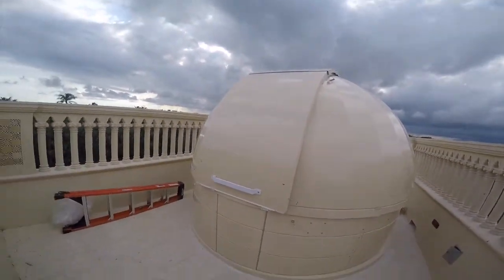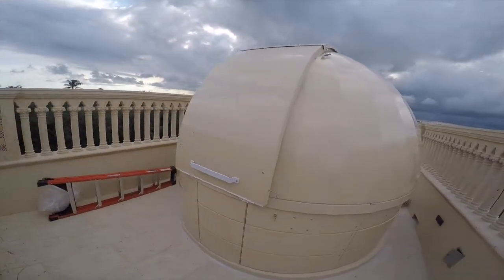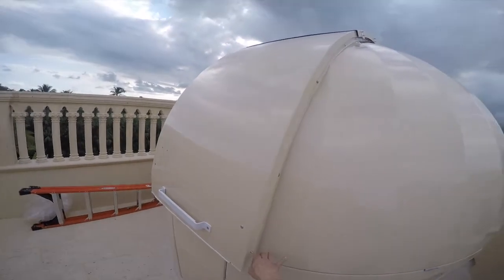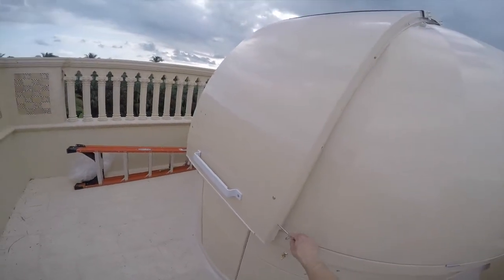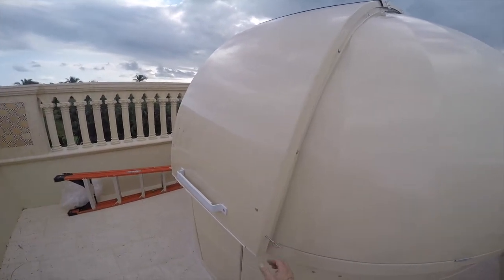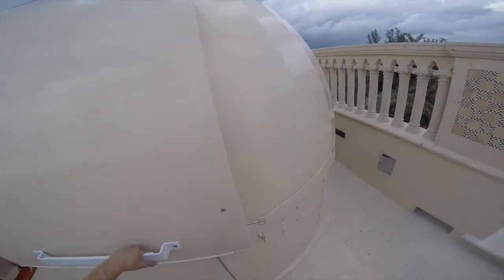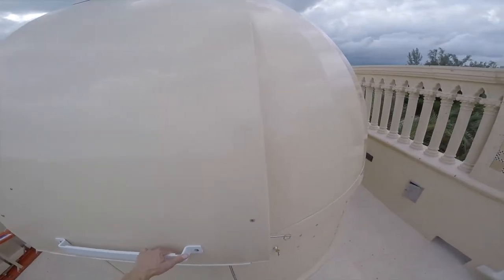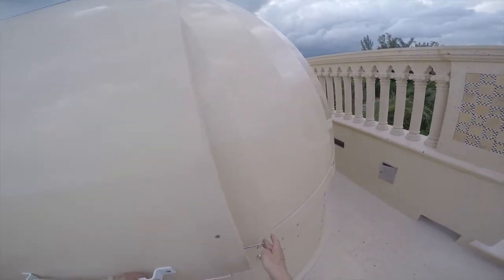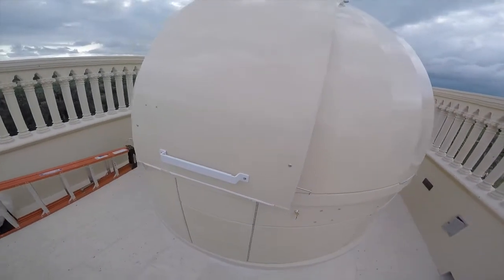We're looking at the front of the dome, the shutter's closed, the doors behind. I've got a couple of pins here on the side sticking out — we haven't put those in. These pins, if you're planning on high winds, I would have them in. They keep the shutter really locked down. Right now the shutter is not going to go anywhere — there are steel cables on the inside holding it down — but under super high winds, this pushed in all the way will lock the shutter in place.